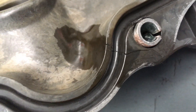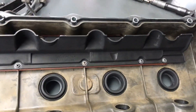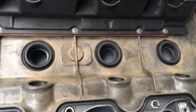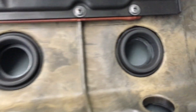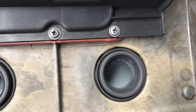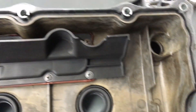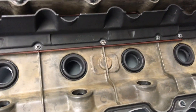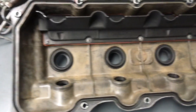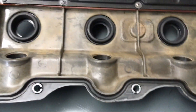There are two different ways to deal with these cracks. You can buy a new valve cover, which is good because the crush tubes at the side where the bolts go through haven't been damaged, so they'll tighten down to the correct height. You also get new seals fitted into the top of the cover, and I think the valve cover gasket as well. It's about 300 bucks — prices go up and down so never hold me to it.